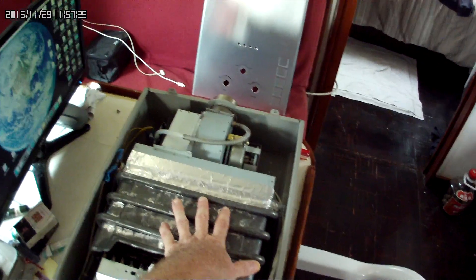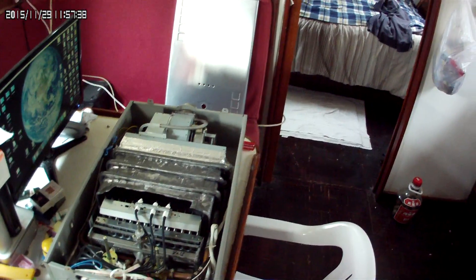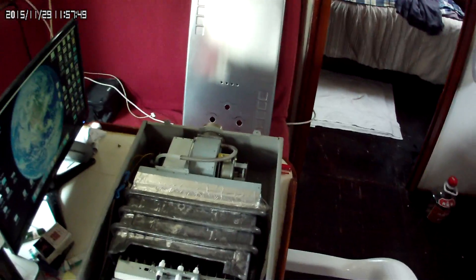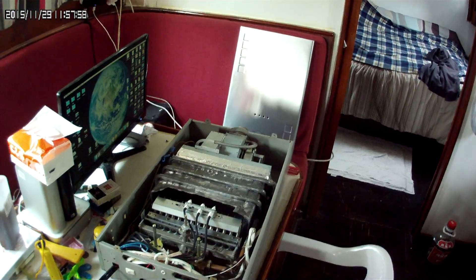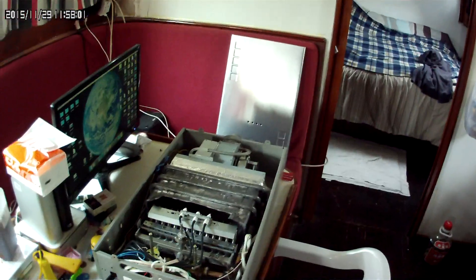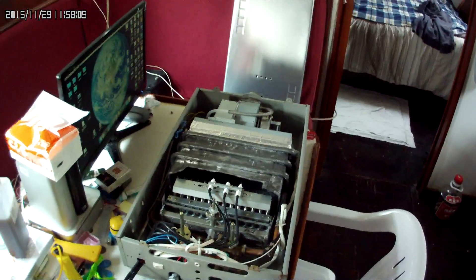The inside workings are not rocket science, but you really should know what you're doing when you open these up. They are cool though. My water pump is 5.9 gallons per minute, keeping everything at 40 PSI. This is going to be restricted here to two gallons per minute, and the tap I'm putting in will be restricted to 2.5 gallons per minute. I'm not going to be using a full five gallons, but the water pressure is there — the volume, the pump is doing it. It's a balanced system, and that's what's really crucial.